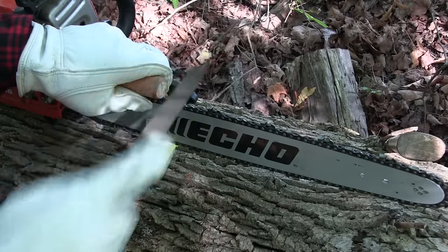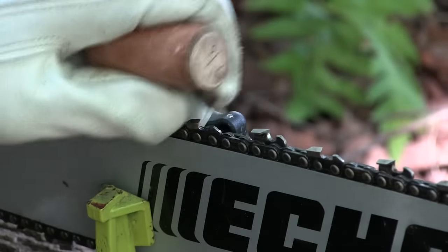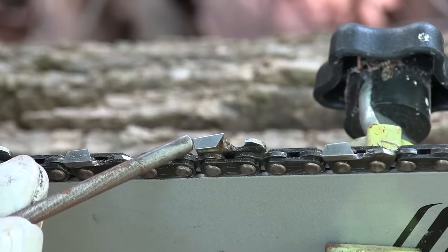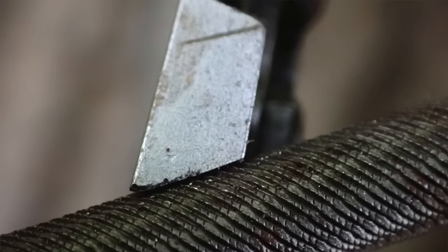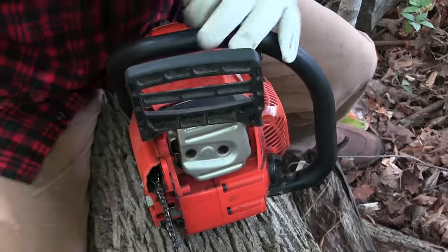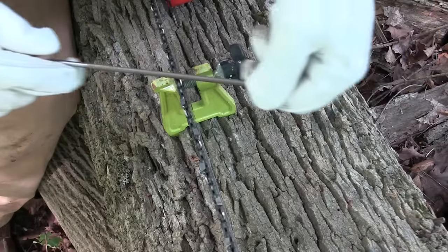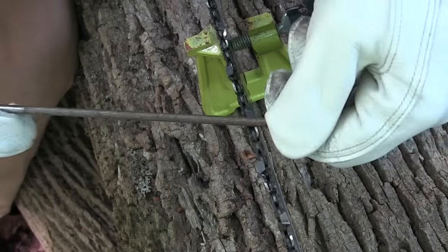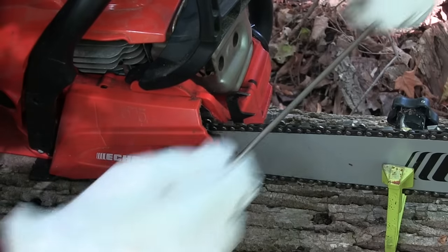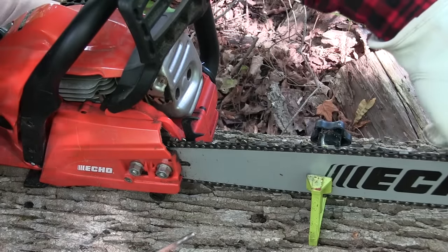If you're cutting soft wood, you can take the raker down farther and it'll pull bigger chunks out. For hard wood, don't go as far — an aggressive chain stresses the motor more. Take the rakers down according to what wood you're cutting. You can see there's a flat spot on top of the raker. I'm judging that by eye and it's always worked well for me. This only takes a minute. They do make a jig for this so you don't have to guess, but I generally just do it by eye. Then set the chain brake and file each tooth.